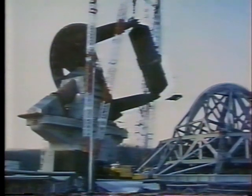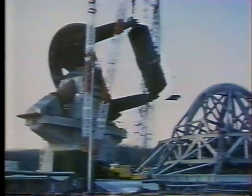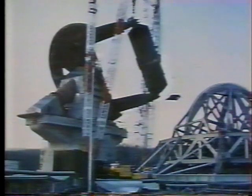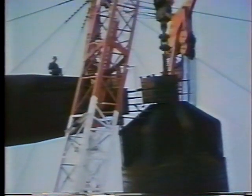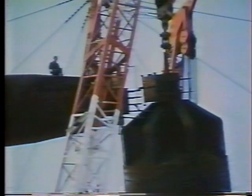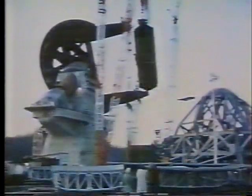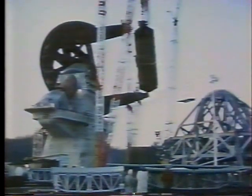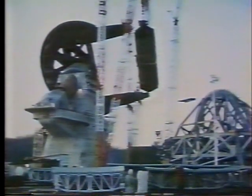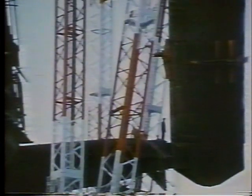It hangs up on the bolts to the upper west yoke arm. The 2 derricks finally pull the top loose without damaging the hold-down bolts, and the load begins to be lowered out of the way. This test tank, filled with water, simulates the superstructure weight while setting the polar gear and testing the brakes and drives.